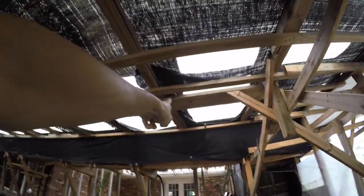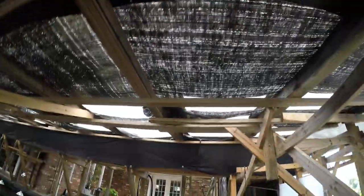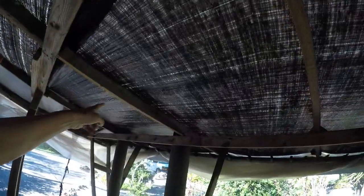This is rafter number 4. So it's got triple 2x4s, then it becomes double 2x4s. And it's attached to the cross piece right here. So this rafter is not attached to any poles, but it runs in between the poles. So that's one, two, this is third 10-inch piling. So this rafter is in between the second and third 10-inch piling, and it is the in-between rafter.